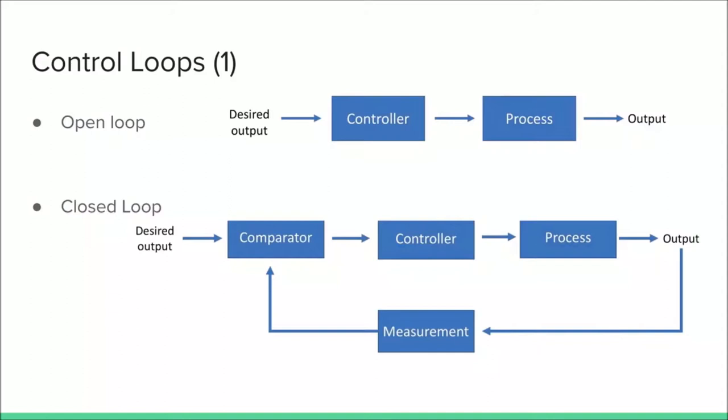In the next few slides I'm going to talk about control loops. Open loop is what you generally start with — you put in what you want to get out of the robot, that goes via a joystick or some code into the controller, the controller converts that into a setting for a motor controller, and the motor controller drives current through the motor so your robot accelerates. What I'm talking about here is making this scheme closed loop: you measure what comes out, compare it to what you wanted, and do something different based on the error.